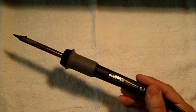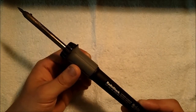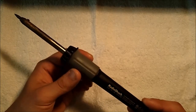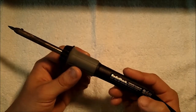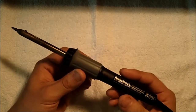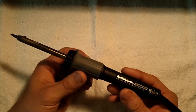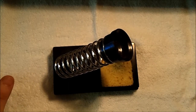Now let's get started with the soldering iron. Here we have a soldering iron I purchased from Radio Shack — it's rated at 15 watts. There are other soldering irons rated at higher wattages, but I found that the 15-watt iron works very well with small electronics. The higher the wattage, the hotter the iron can get. Higher-wattage irons are usually used for larger electronics.